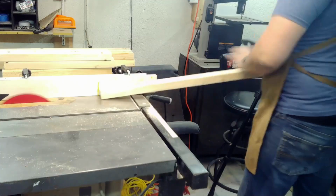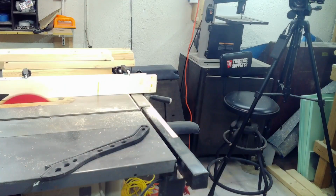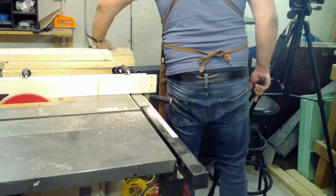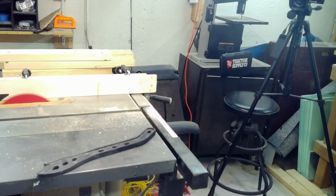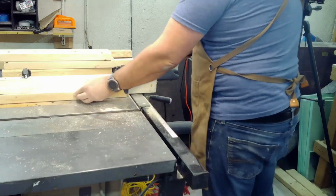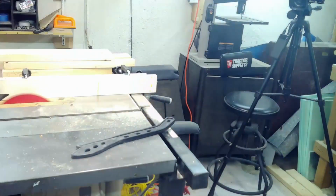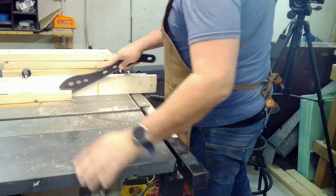Now, before anyone jumps on me for not using pressure treated wood, I will be sealing these off later in the video, and this was the first one where mistakes will likely be made. Also, the pressure-treated 2x4s available were, shall we say, less than desirable. I do, however, recommend using pressure-treated wood if availability and decent quality. The trade-off here is I'll likely have to reseal these every few years. Keep those edges, though. They're good for making little Easter baskets, which you'll see in a different video.